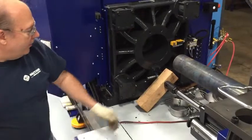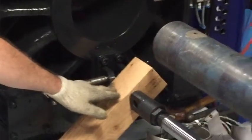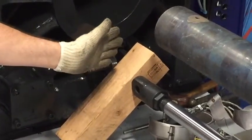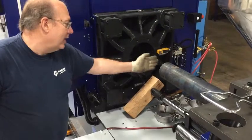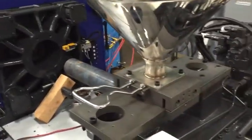So what we did was we removed the pin for the carriage cylinder. We're using a piece of 4x4, and we're going to go ahead and run the injection unit back a little bit further so we can increase this distance from the face of the stationary platen to here. So now I'll go ahead and pull the injection unit back a little bit.